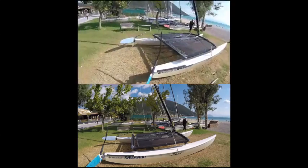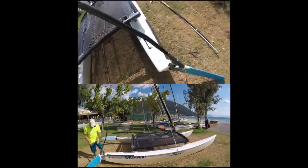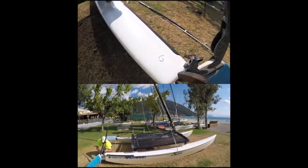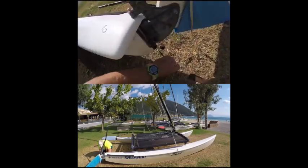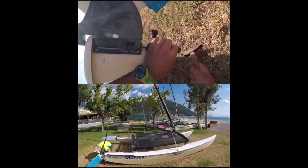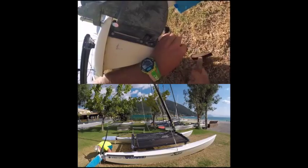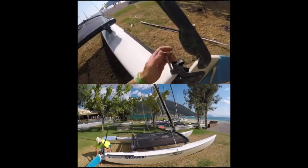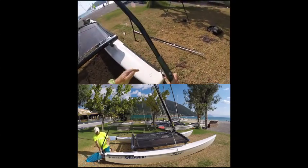So I'm taking our handy tool. This is all in the rudder servicing video, and we're going to try to never actually hit the rudder pin directly on the end because it's going to flatten it. Instead we'll use our special tool and we'll knock that upwards. Now hopefully this will come out a bit easier.